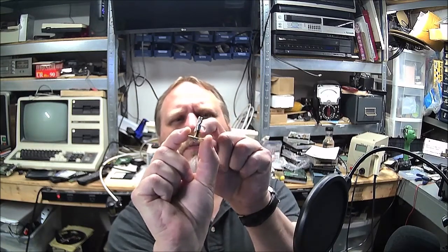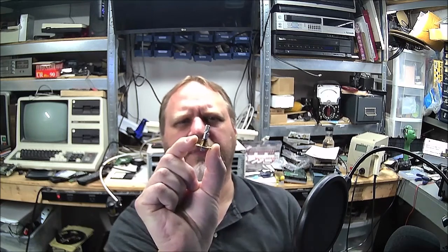And then after I did all that stuff, I went looking for a replacement control, and they are out there. It's a 10 kilo-ohm audio taper control. It's a single gang, so it's only for monaural, so it has 3 pins for the potentiometer part of it and 2 pins for the power. Although by its design, the 2 power pins are actually 2 wires that come out, but those can easily be cut and soldered to a new one that has solder lug terminals or something I can solder to for a modern replacement. The problem is the shaft of the potentiometer, and I have part of it here from the disassembly. This shaft from the panel itself, where it would mount to a panel, to the top is about 1 inch long, and you can't find them that way, 1 inch long with single gang and with a switch.